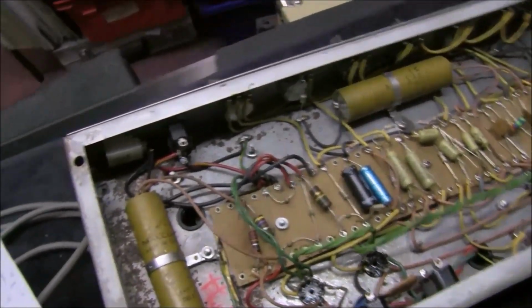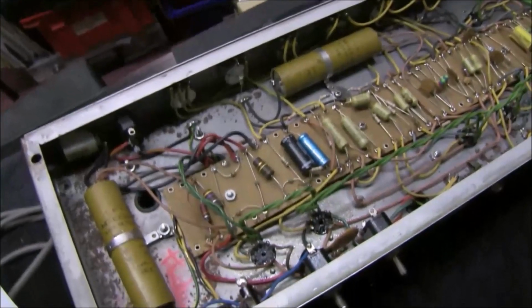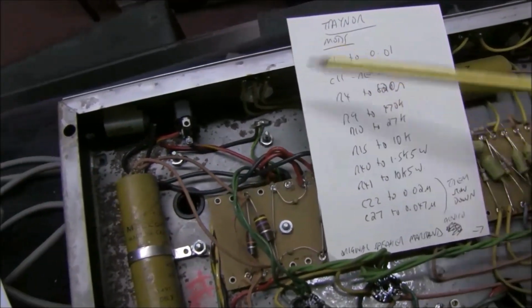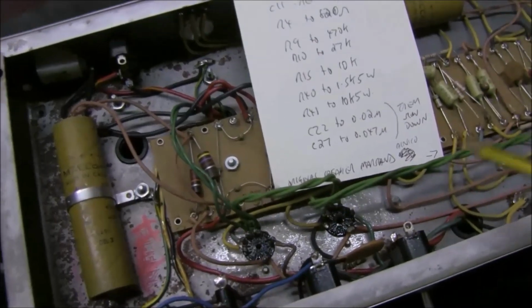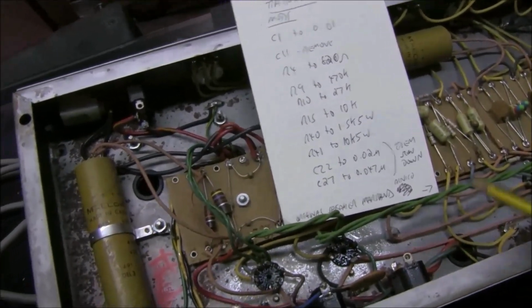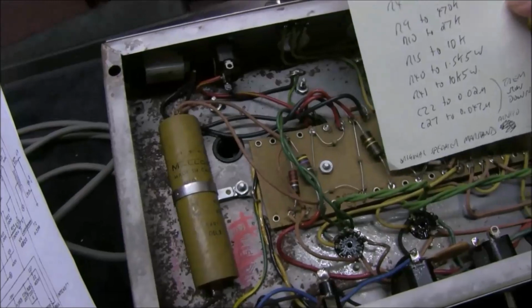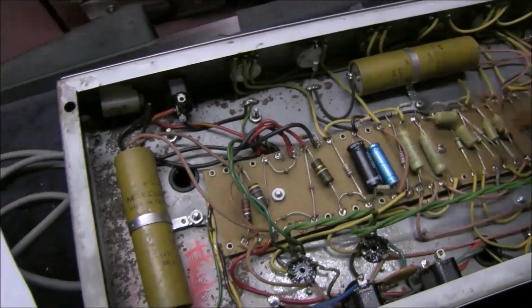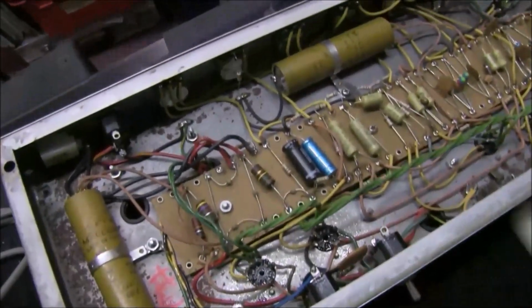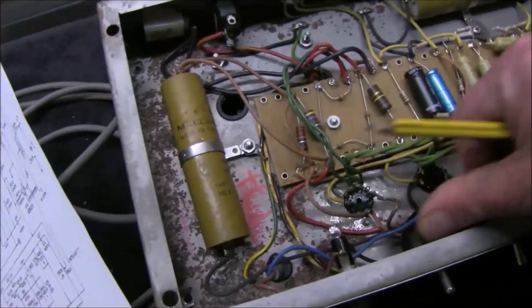Now, there are some modifications people do to this amp for some reasons, to change the frequency, the treble, and that, mainly from what I can gather. I will have a look at them. I actually made a little list of some of the things that people change, all the resistors, capacitors. One of the things, most people tend to slow the tremolos down on modern amps. We tend to use slower speeds now. You can normally do it by changing the capacitor values slightly, making them a bit bigger. Some of these other things, people talk about instability, oscillations and all sorts of things, which if it occurs in here, normally it's either a lead dress, assuming the components are fine, or something very small. This is an oscillation.